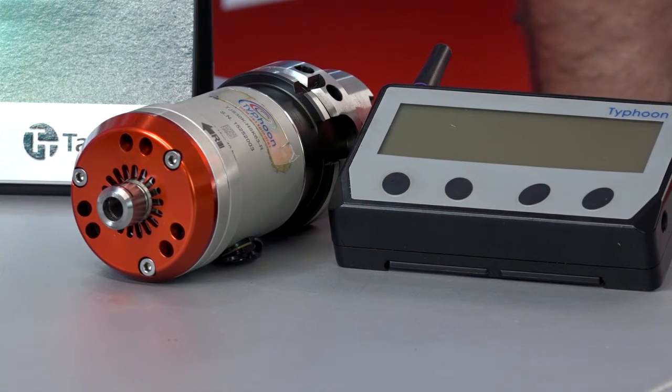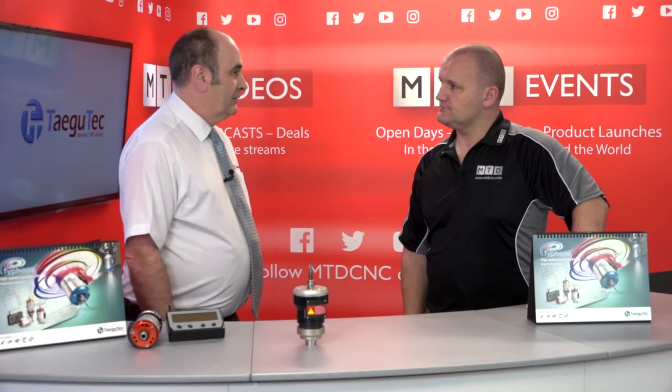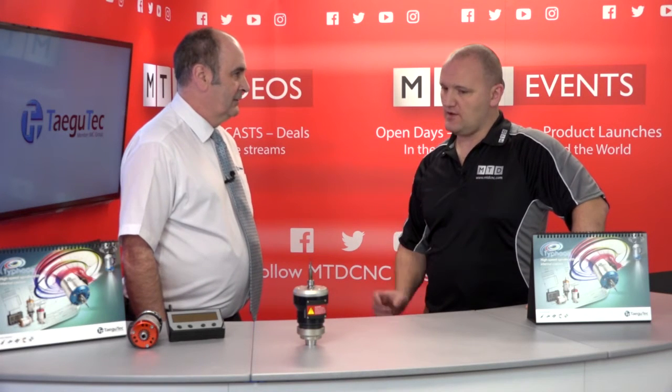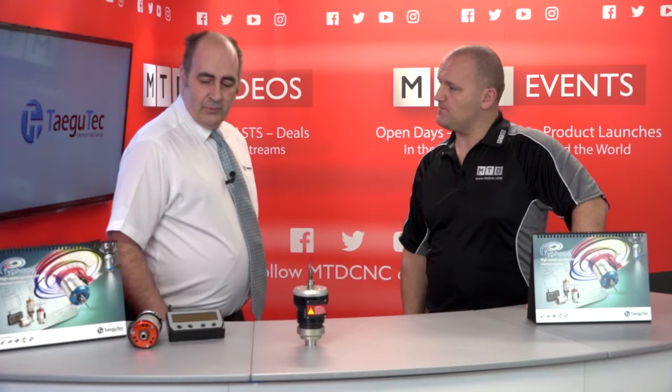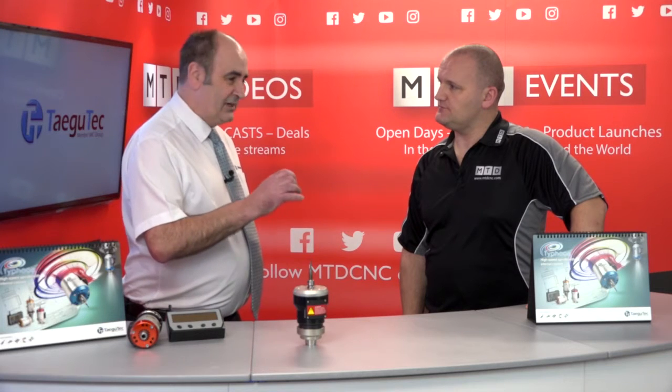Also good for small diameter tools? Small diameter drilling, solid carbide rib cutters, thread mills — you can even use it as a grinding unit. It's a very flexible, versatile system mainly aimed at small diameter cutters. The front end is an ER11 collet and you can put up to a 6mm shank into it comfortably. You should be using 4mm and below on steels and aluminium.